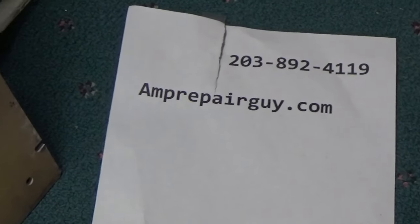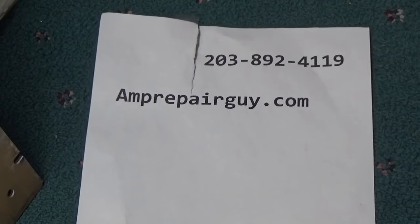I had a Swan Mark II that was really butchered up by the person before me who worked on it — not the owner. They ended up cooking the transformer in the external power supply cabinet, which has a low voltage winding and also the plate and filament winding. The transformer is sourceable, but the customer did not want to replace it, so fortunately I won't be fixing that.